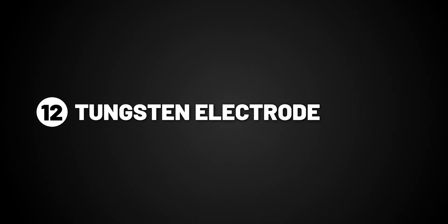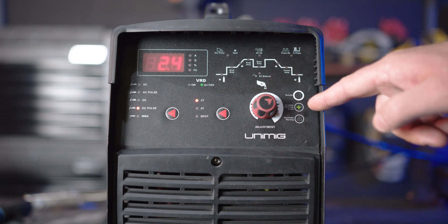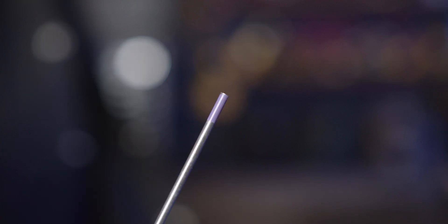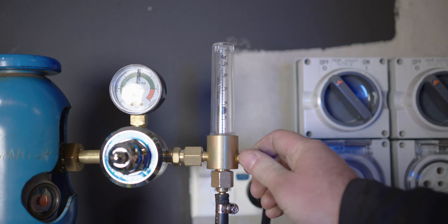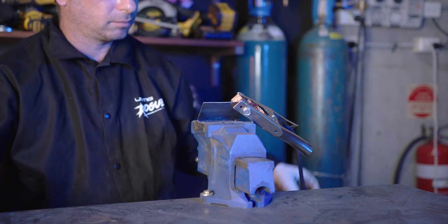Part 12: Tungsten electrode. You'll need to choose the thickness of the tungsten electrode. We supply four types: the grey tipped ceriated, the white tipped zirconiated, the purple tipped E3, and the gold tipped lanthanated. We'll be using the gold tipped lanthanated as it's more versatile and has better arc characteristics. Now that you have set your parameters, turn your gas on to about 8 to 10 litres per minute and attach the earth clamp to your workpiece. You are now ready to weld.